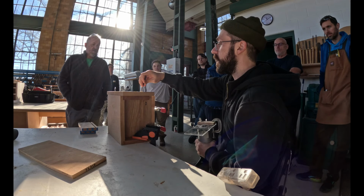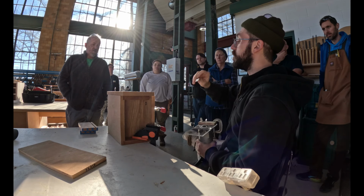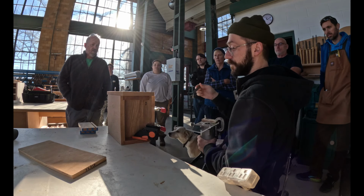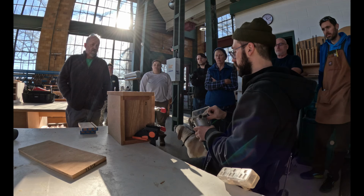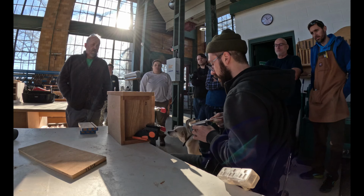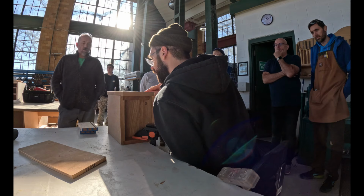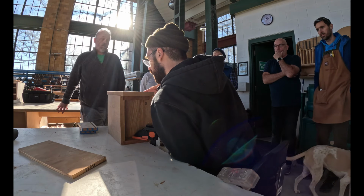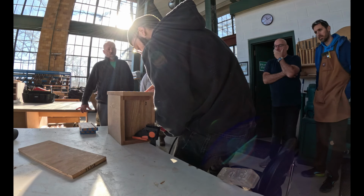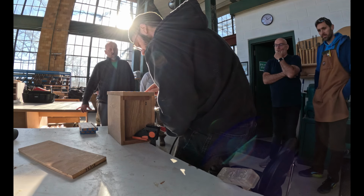Right back here with the blue tape. So we need to hit this wall and that back wall. And you can get really close with this and establish those walls clean and have really little chisel work to do. So there's one more step where you clamp a random piece of wood on here. We find the widest point of our bit and I'll measure here from the back, from my face here to my blue tape. Looks like I'm at about 9/16 approximately, really like 8.5.